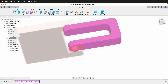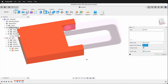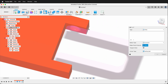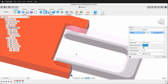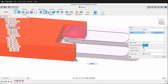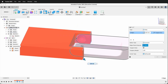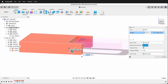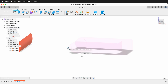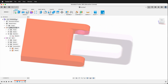So now this piece looks really nice. Let's go ahead and activate the socket component and add some fillets to it — I'll click Fillet and add a fillet here, here, here, here, and here. We can do this fillet at height divided by 2. We'll go ahead and grab these two pieces too, and it'll be height divided by 2. And that makes all of those round.